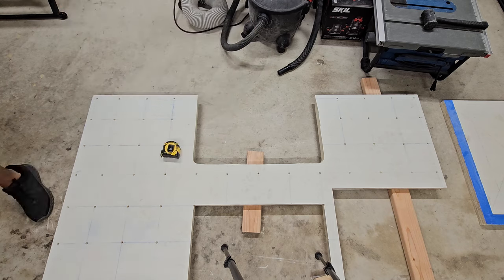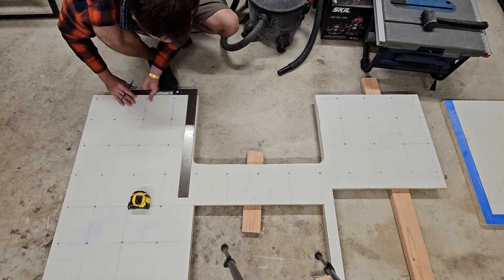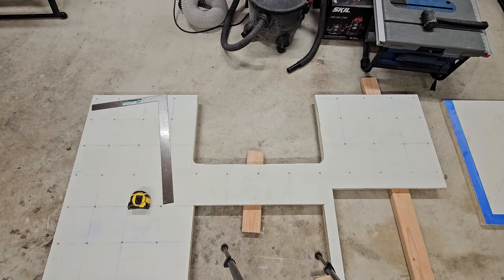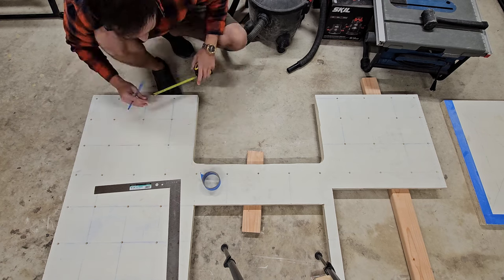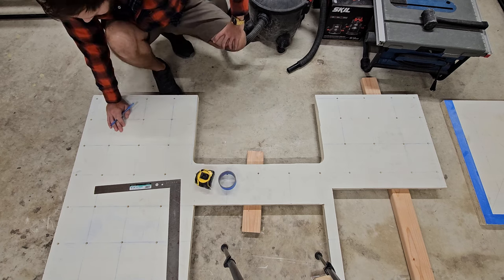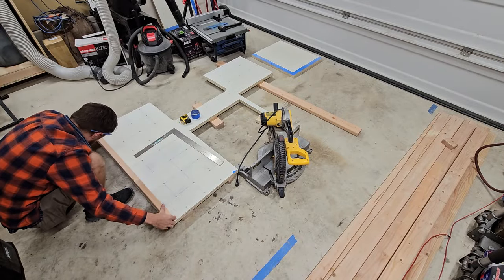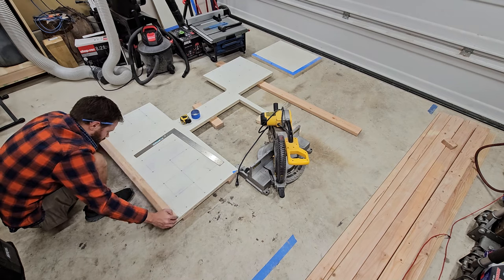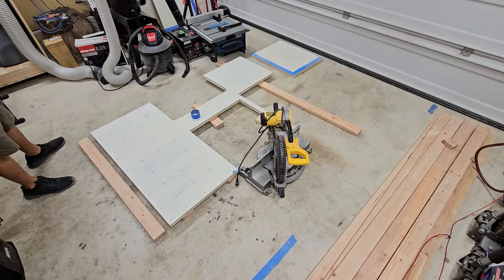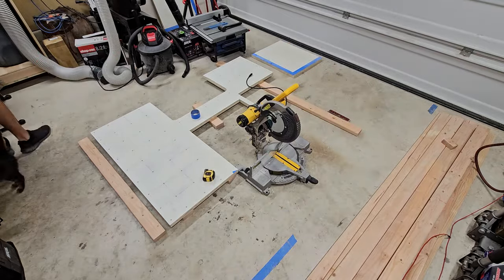On screen we're looking at the bottom side of that workbench tabletop area. I used a jigsaw for this cutout and by the time the blade protruded through the bottom of that cut — which we're looking at the underside of — it had flexed and gotten out of alignment. I wasn't satisfied with how that came out, so I decided to revisit the issue further along in the build and make any remedies or fixes as needed.